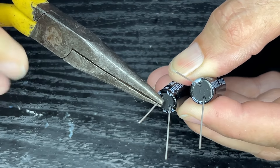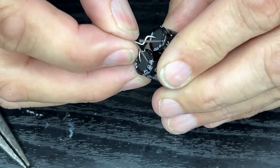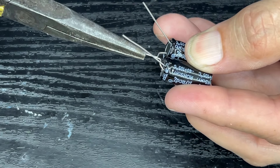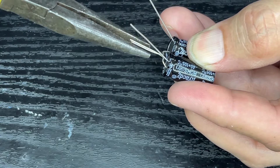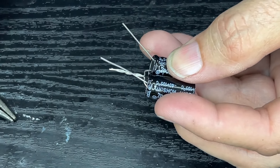I'm doing a little bend in, then a little bend that way, then a little bend up the way, so that we can join these together. Okay, that looks not too bad. These are not the right pliers to do the job but I'll give it a shot. I'm sure there's a wire twisting tool out there on the internet. That'll do — just a wee bit more, nice and neat, because I want to be able to put some heat shrink tubing over this. I do not want these two sets of connectors to join.